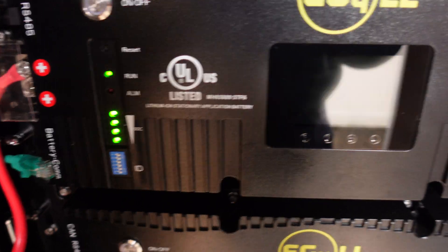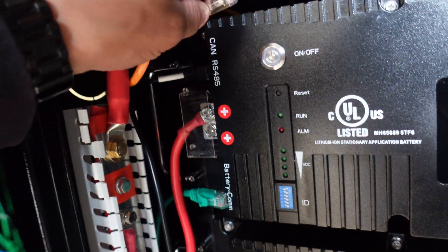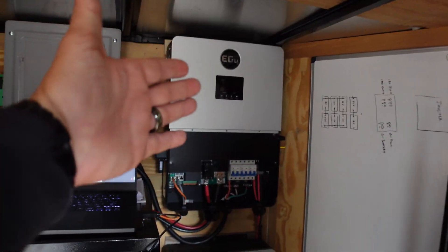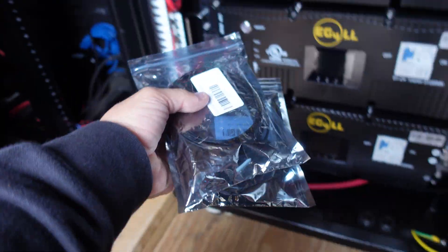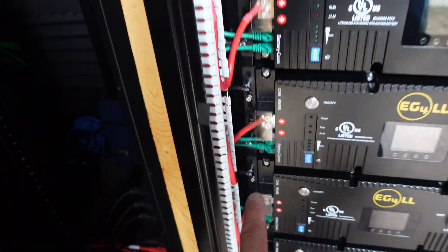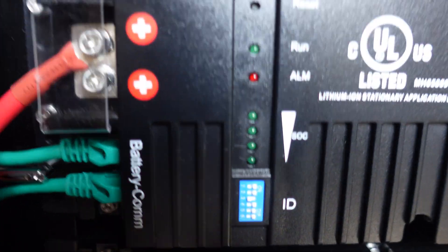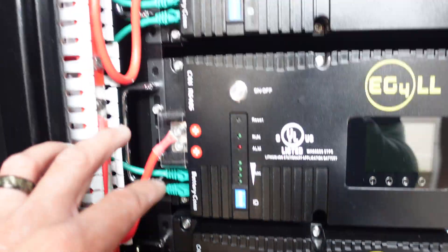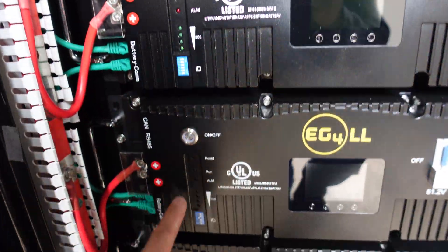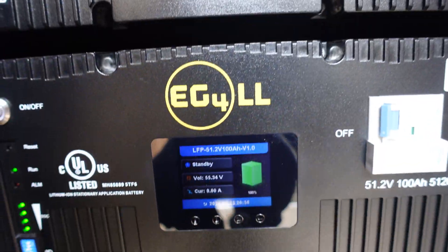Close serial port. It's back on. I'm going to shut that off, put it back to ID 1 off of ID 0. Let me run through all these and hopefully they register as lithium iron now — that'd be sweet. I'm going to take these cables and just leave them down here in case I ever need to do any new firmware updates. I got all the cables back plugged in and all of the dip switches situated. They're all back and not at ID 0. Let's turn on all the batteries one at a time and make sure they all come on and they're not soft bricked. They're all on, they're all at 100. Hell yeah.